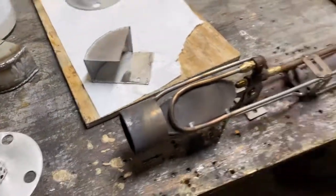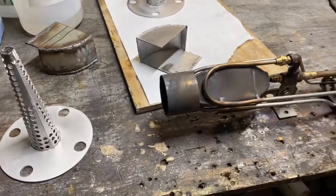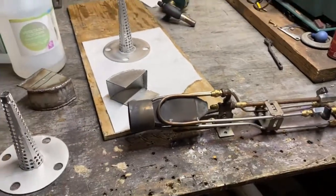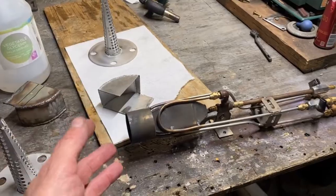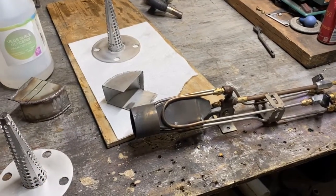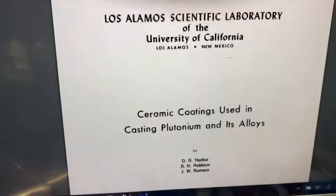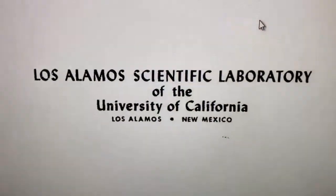What I want to do is etch this burner and coat it with a spray coating — three mils of a high temperature ceramic coating that I'm going to make from some information I got from some old Los Alamos laboratory literature that I found. I've been known to dig deep down into the PDF files when I'm really looking for some cool stuff.